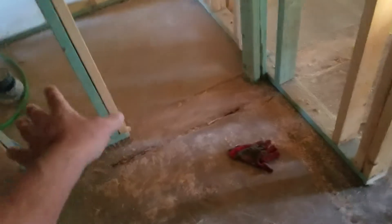Grind, profile, and stitch — two stitches here and stitch this hallway. Then we get into this area that needs to be ground down: remove this thinset, profile this area, grind it down to a better profile so it has a nice transition, and put at least two stitches here as well. If need be, we can put a floor leveler here in this area just to make a nice transition through. Going through the hallway, this joint here should also be profiled and stitched — one foot off the corner, one foot off the corner, every three feet.